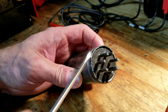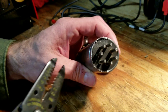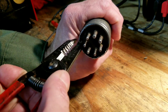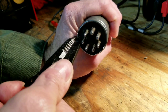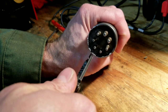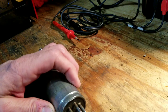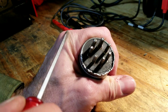Now you can see I started working my way around the rim of the can, and as you open up that crimp you get your pliers and can start straightening it out and widening the mouth so that there's enough clearance. Once you've gotten a start on it, it's a little bit easier on your knuckles, which if you're doing it this way have a tendency to get in the way of the point of a screwdriver.